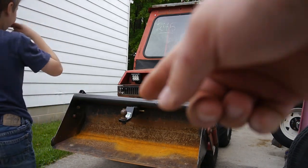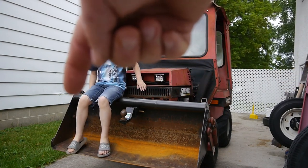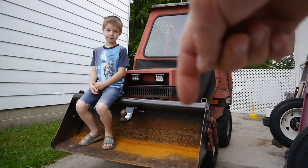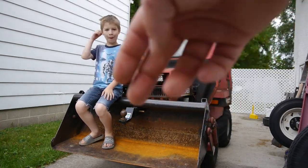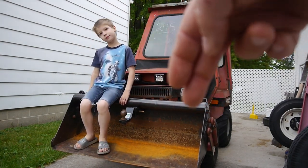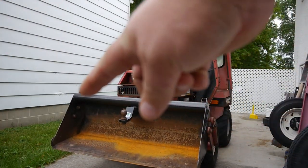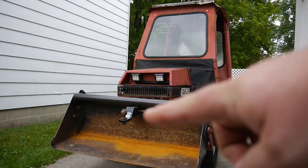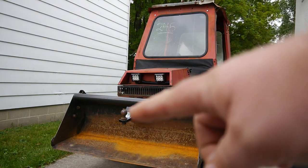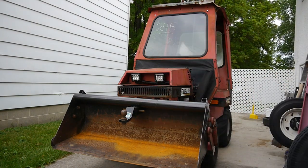So, we went ahead and welded in a, what is this, 2.5 inch? No, 2 7/8, sorry. So that'd be what, 2.5 inch pipe? So there's a 2.5 inch Schedule 40 pipe that I welded in here, because I'm going to put a grappling bucket on here at some point, and that'll all get mounted to this. I also put in a receiving hitch, because I'm lazy and I don't like lifting trailers, so now I can just get underneath the ball, lift it up, and take her away.